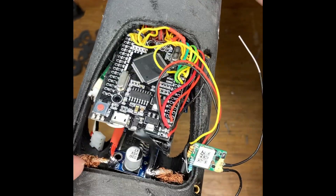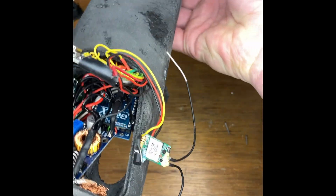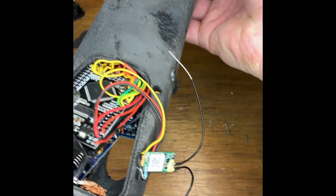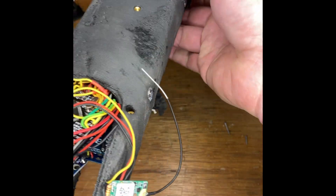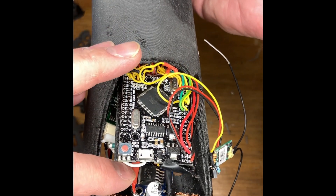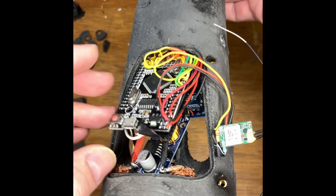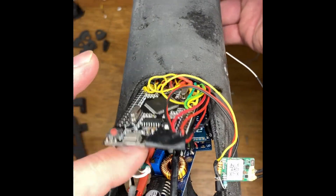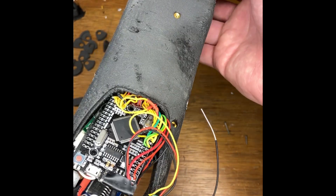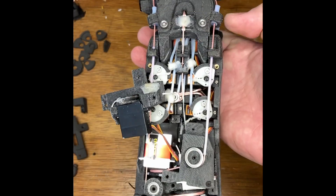This is how I connected to the batteries — just by wedging some copper in, which is not great. And that is a DC-DC converter. I've been trying to find ones that are not counterfeit, and I've been unable to do so — apparently the chip number is just sprayed on. When people have analyzed them they work completely differently to the real ones. It works but does blow up every once in a while. Long term that will disappear and you'll pipe in power to charge the batteries, which then supply the juice when needed.